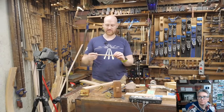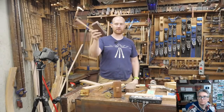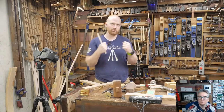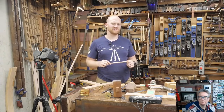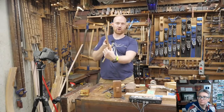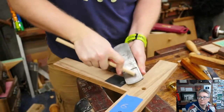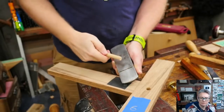That's a drawbore dowel — the only way you're getting this apart is to drill out that dowel and destroy it. You'll never push that dowel back out, and that makes it an incredibly strong, incredibly functional joint that needs no glue at all. You see this on a lot of antique furniture. You can use dowel stock, or use a dowel plate to make your own. For wood: nothing soft, you want something stiff — hickory, oak, maple all make great dowels.